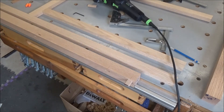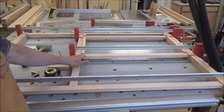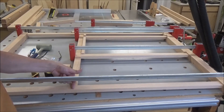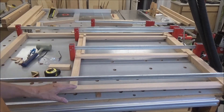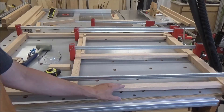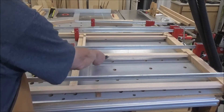I've been away from the project for a few days — the weather's been nice and some other things came up — but I came to the realization that I cannot use the tight setting on all these joints; I just could not get it square. After redoing the joints, I left the cross-grain joints alone and adjusted the ones going with the grain. All the domino mortises in the legs are tight settings, and anything running perpendicular to a piece is a tight setting. I loosened up the others, dry fitted it, and I am very, very happy with the way it lines up now.